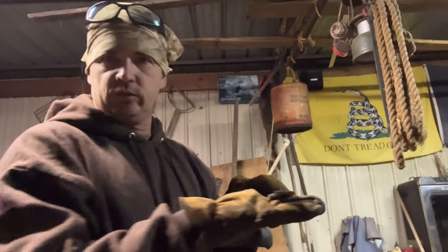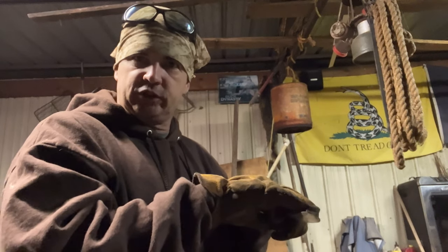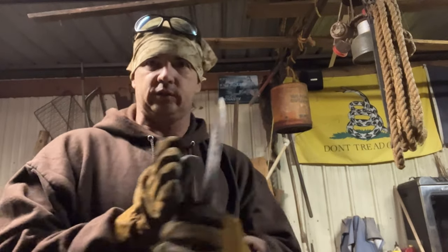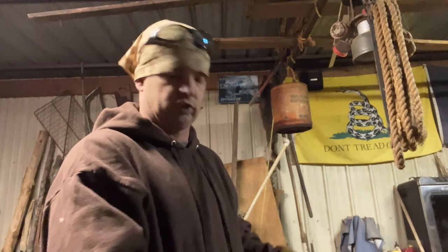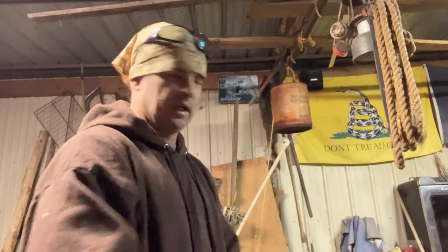But to get the angle the same, once I've hammer forged that fairly flat, I can feel when I push it down on there, it'll lay flat on that belt and I can feel it. So if you ever grind a swooping bevel on there, what is called a convex grind, then it makes it much more hard. The way to fix that is to put it down about where you want it and just hold it still for a little bit. And it'll make that flat. The more convex you get it, the longer it'll take it to be flat. But if you're steadily moving it all around with a convex, you're never going to get it out of there. You got to put it down and hold it still.